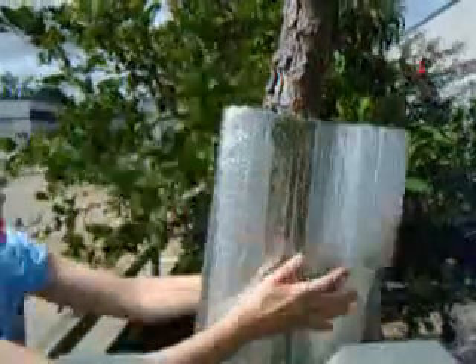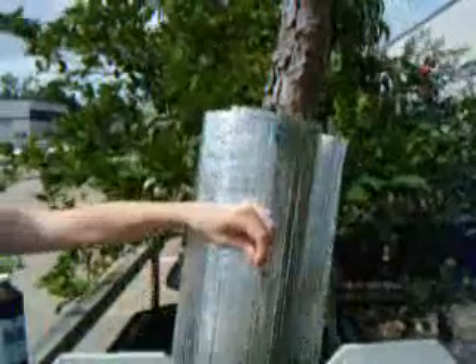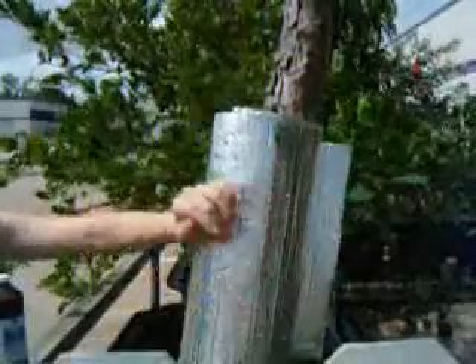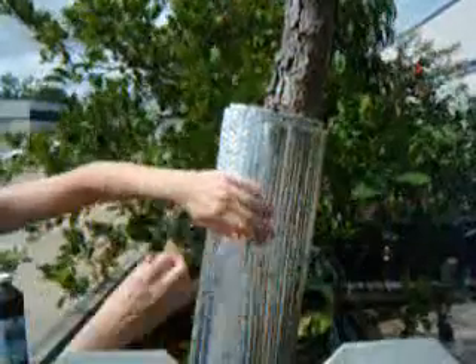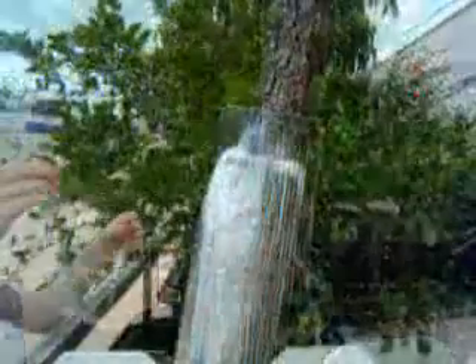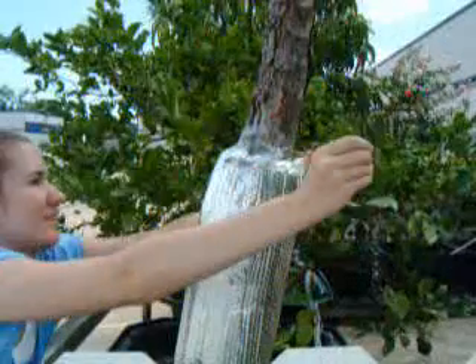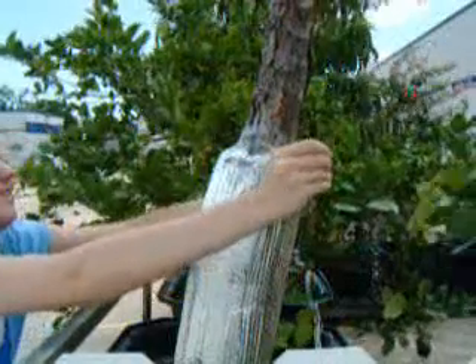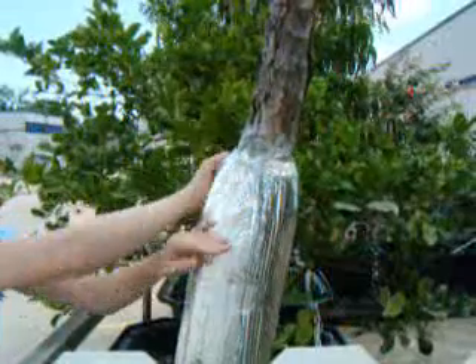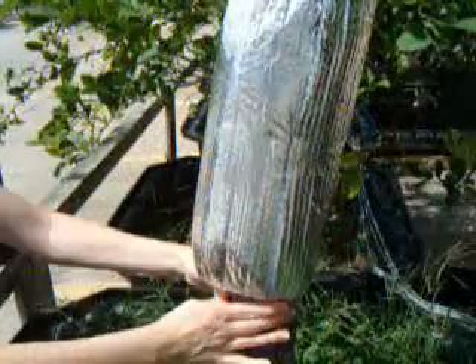Reflective bubble wrap insulation is now wrapped around the tree, foam blocks, and the TDP installation. The reflective bubble shield provided is enough to form a tent or skirt around the tree where the measurements are taken. We must prevent solar energy from heating the stem area, as solar and ground heat will interfere and add or subtract a temperature gradient from the sap flow probe signal. The bubble shield wrap should be secured with clear or reflective tape, with the top securely sealed to the tree trunk to prevent rainwater running down the stem and touching the sensors.